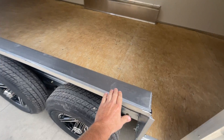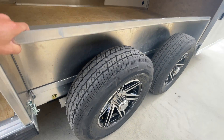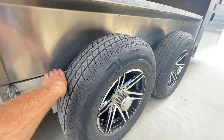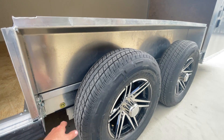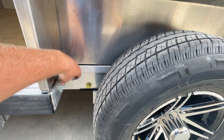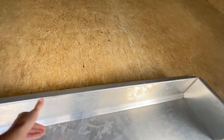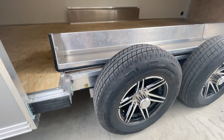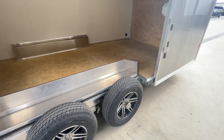When you go to the full escape door, you get the removable fender. Fairly simple to deploy. You can see that whenever you take that fender off — and I can't do it very easily with one hand — your floor height is going to have probably 7 inches left, and you can open almost any car door with 7 inches of clearance. But this fender, might be able to do it with one hand — you can do it with one hand. Fairly simple to take off. You've got maybe 7 inches or so of fender reveal left after that fender comes off, which allows you to open pretty much any car door.